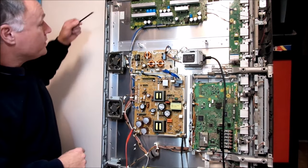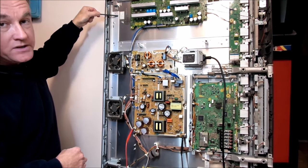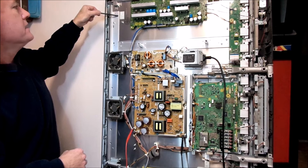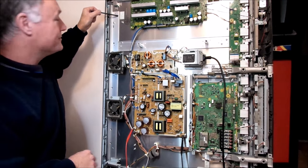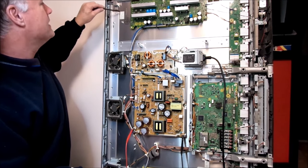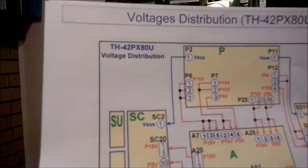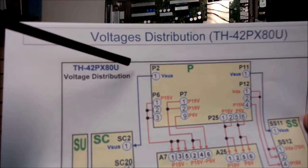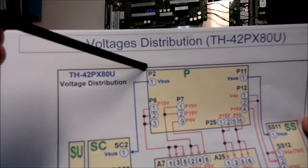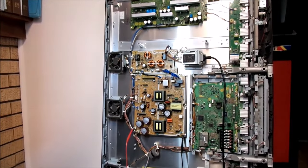Be very aware of the high voltages in this particular area. You've probably noticed up the top here there are two voltages mentioned. One is VE, and that's 145V, and V sustain is 190 volts. According to my schematic here, the Vsus, or Vsustainable voltage, is at terminal P2, or connector P2, terminal 1. As you can see, I've got that already hooked up for us.